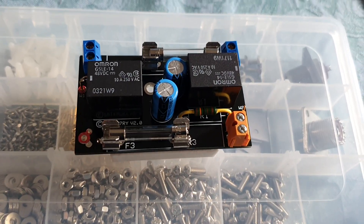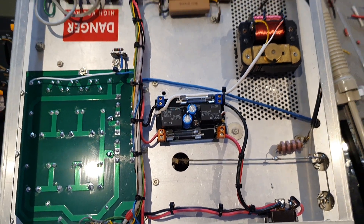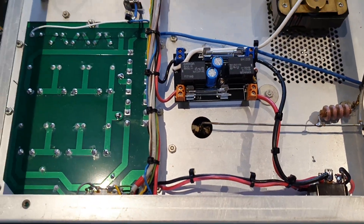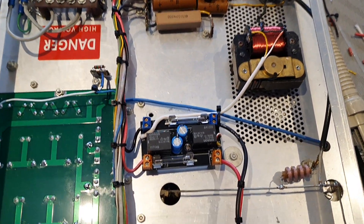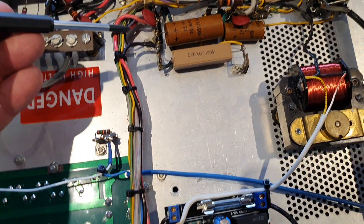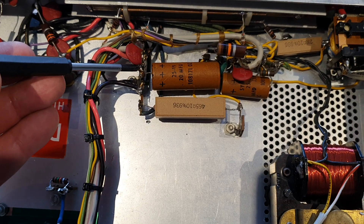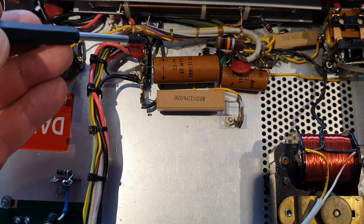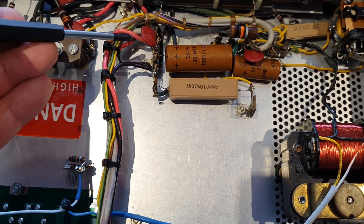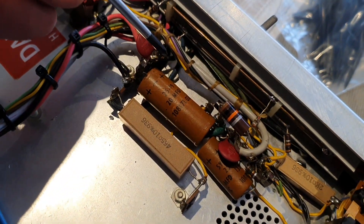That's ready to install. I've already got one installed - this is my backup for whatever project comes up in the future. Here's the finished installation. I've just neatened up all of the lines, and it gave me a chance to go over and check other connections on all of the tombstones. I actually found this capacitor shorting out on the positive VAC line, which it shouldn't be. It's a separate line. So that capacitor goes to this capacitor, and the 120 volt that comes out is on a totally different tombstone - that's on the fan's tombstone. So there was a bit of an issue there.